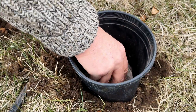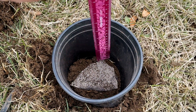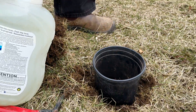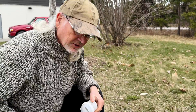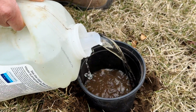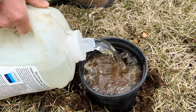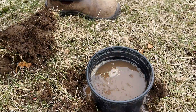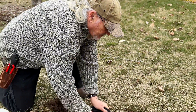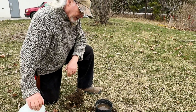And then we're going to put our little rock in the bottom — thusly — so that when we fill it up with water we can measure from a regular spot. Now we're going to fill it up with water and let it drain away. That will saturate the soil, because we don't want to be testing just how dry this soil is and how much water it'll soak up — we're trying to test the actual infiltration. It'll take a couple of minutes to drain away, and then we'll fill it up again and measure.